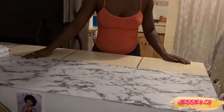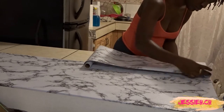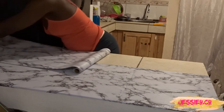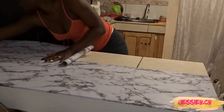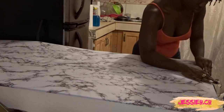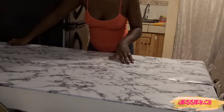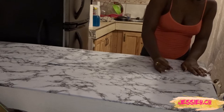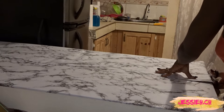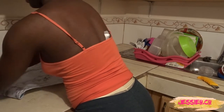You want to do it in small sections and remove any air bubbles along the way — do not leave air bubbles there. Raise up the contact paper if you have to in order to get rid of them. For the second area I did it differently: for the first area I used one full roll, rolled it out, placed it, and used my exacto blade to cut it along the wall. For the second area, next to the fridge, I measured precisely, cut it with scissors, and then placed it. That area was small and sensitive, so that method worked best. I also cut it a little big so I could cover the front face of the countertops as well.